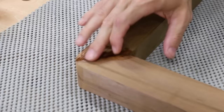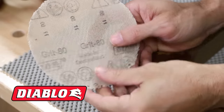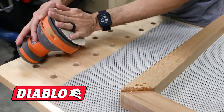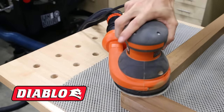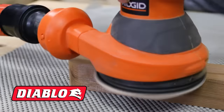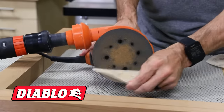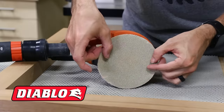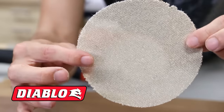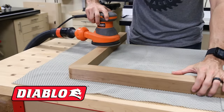Epoxy leaves a mess on the joint and sanding it can really clog up regular sandpaper. But I'm using Sandnet sanding discs from Diablo, the sponsor of today's video. These discs have a clog-reducing net design versus a normal solid paper disc — the see-through net gives all the dust and epoxy a place to go instead of getting stuck and gummed up on the surface. The 80-grit disc blasted through the epoxy quickly and got me down to bare wood. The connection pad lets the discs fit on any sander regardless of the hole pattern, and after use you can vacuum, rinse, or shake off the dust and reuse them up to 10 times longer than regular discs.